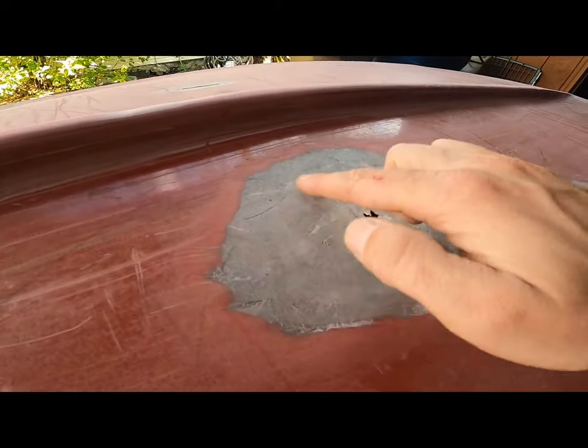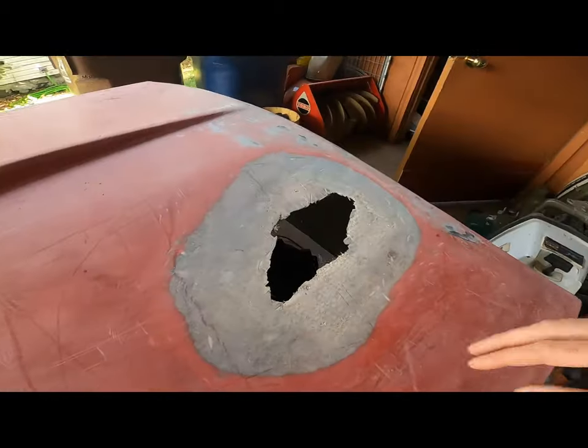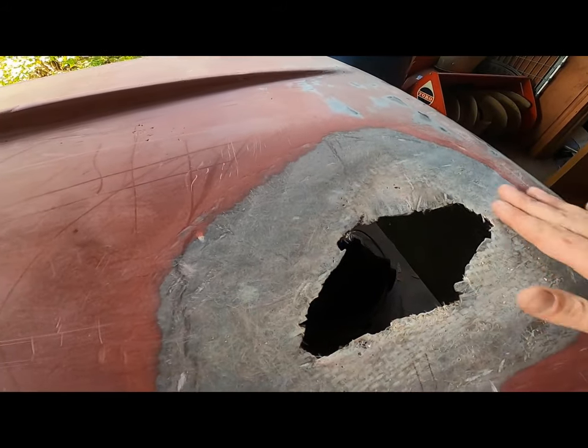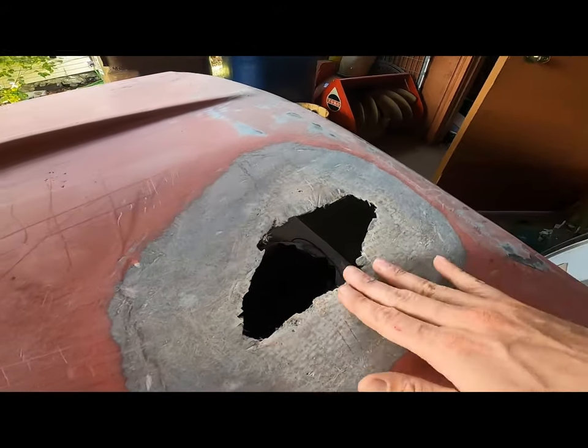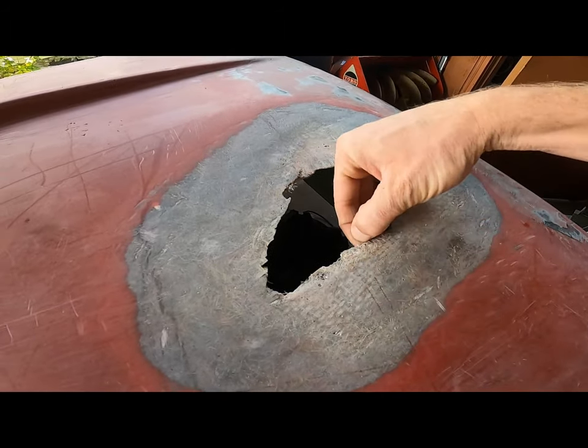For the most part the whole hull is prepared for the fiberglass work. I need to make sure that I feathered evenly around this because it's a little bit of a hump here still, so I'm going to touch it up along this edge with my grinder — I want the fiberglass cloth to lay evenly, not be wavy. I'll also feather the edges more on these other sections. My small camera tripod broke, so the footage might not be the best.